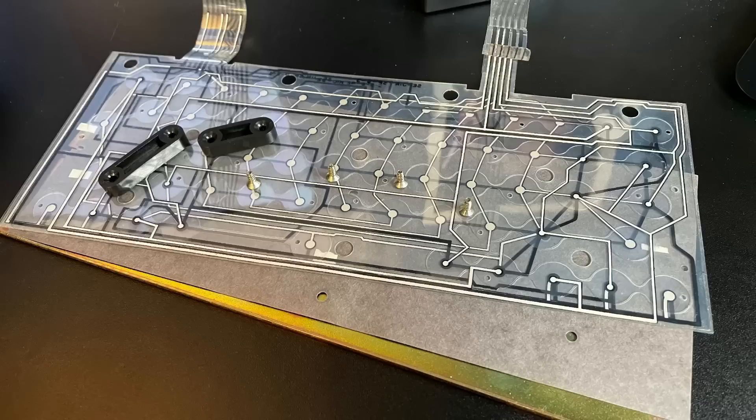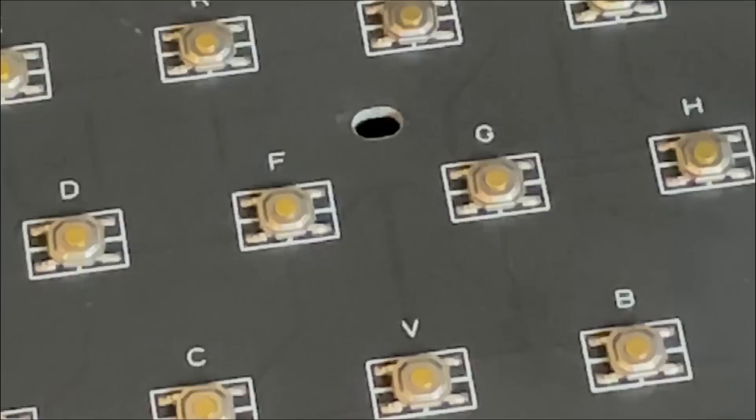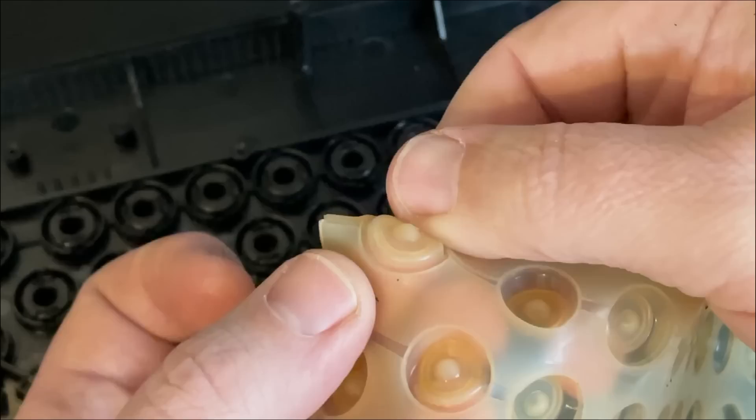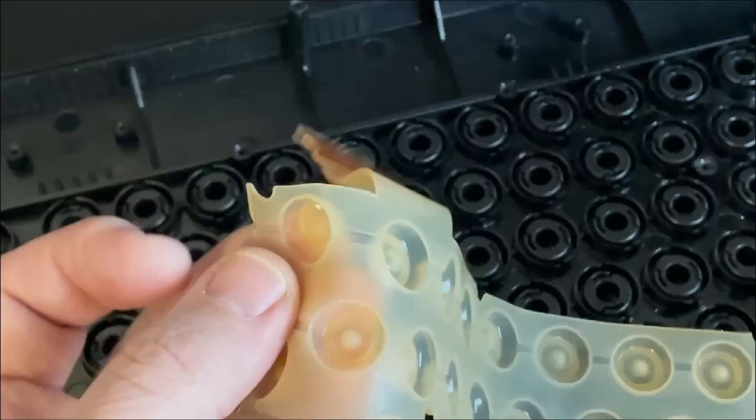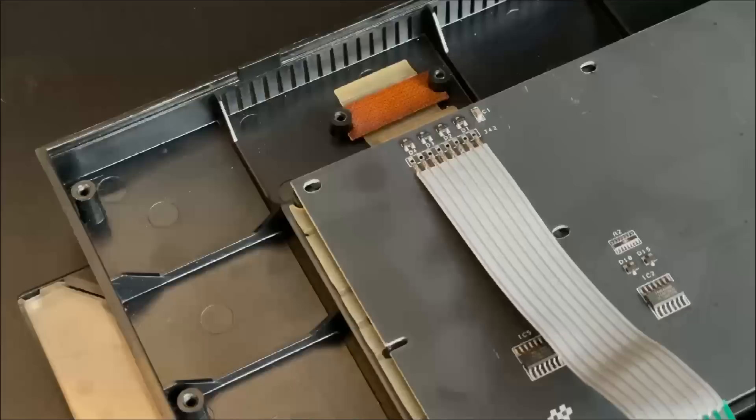And if this new PCB works well, we can hopefully pop all of that stuff in the spares bin to help revive another Spectrum. Now, the interesting thing about this new keyboard matrix is just how small these little tactile switches are. It's going to need to be either extremely well engineered or we're going to have to be very carefully positioning this, as there's not much room for error with the little plunger on the bottom of the key having to hit this tiny switch dead on. The instructions don't fill me with confidence as there's a section which basically says you'll have to fiddle with the alignment of this to get it to work. Let's pop it in and see how we get on just following the photos in the instructions as a guide.